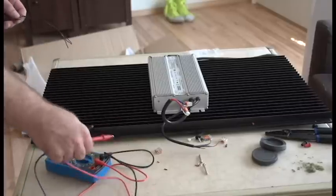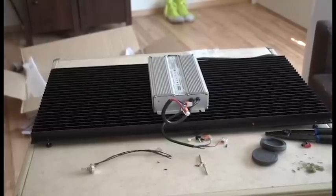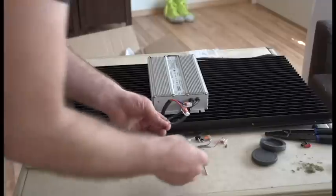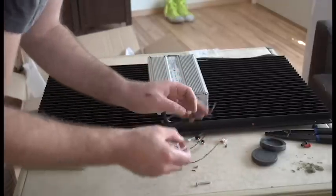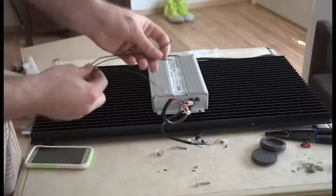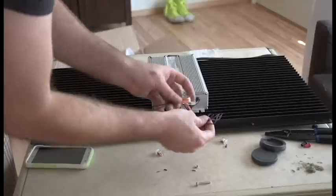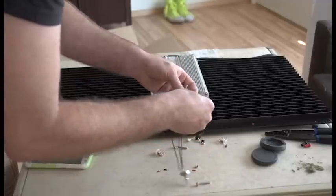Okay? Always turn off your multimeter, because you don't want the batteries to die. So, this one is good and ready to rock and roll. So far, potentiometer, we're gonna take our middle wire, and we're gonna connect it via Wago into our potentiometer. So you take that center wire on your potentiometer there, think that's got connection. Then you connect it to the little gray wire coming out of this one here on your board's driver.